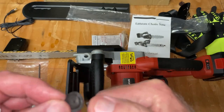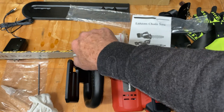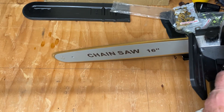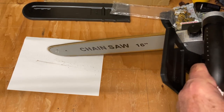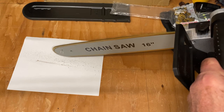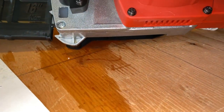Now it looks like there's a vent hole punched but the punching didn't come out, so I push that out — it won't stay in there and I might have to add something to make it stick. I like to see some oil flung off the tip. If you use a good chainsaw oil it's got an additive that makes it cling so it won't fling off as much, but this isn't a good chainsaw oil so I expect to see some splatter. There's some coming off — not as much as I'd like, but it is oiling. I let it sit for a day and as I expected, a lot of oil leaked out, but that's the nature of these beasts.